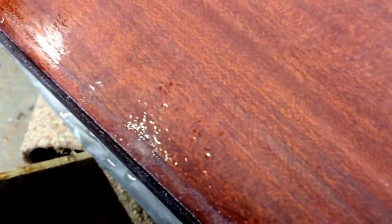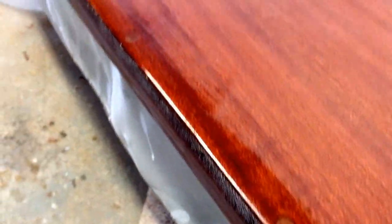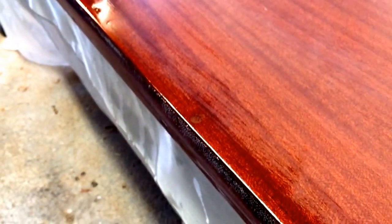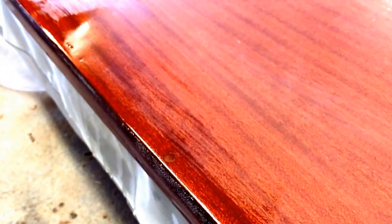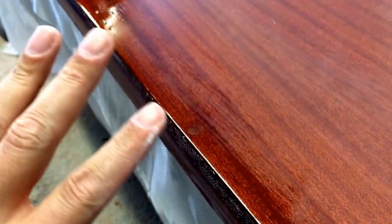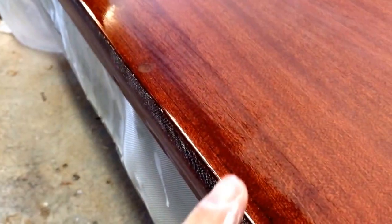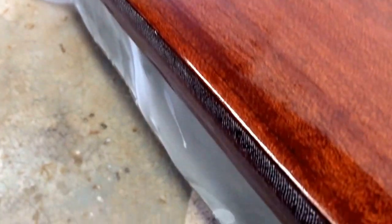It's not perfectly squared. So what I did — I wanted to see how that actually comes across when a varnish is actually applied. Will a varnish coat actually hide a little bit of that? So I did a real brief test of some Epiphanes varnish. Just a note: I actually asked a rep, and they did pronounce it Epiphanes, not Epiphanes. I applied some of that varnish, thinned down, just a tiny area and application, just to see what kind of finish it provided and also if it concealed that issue.